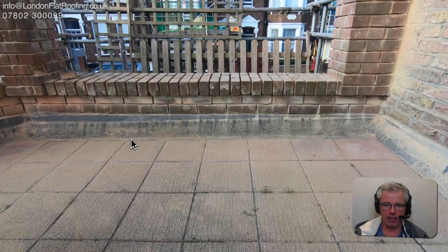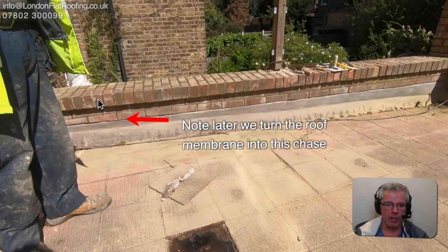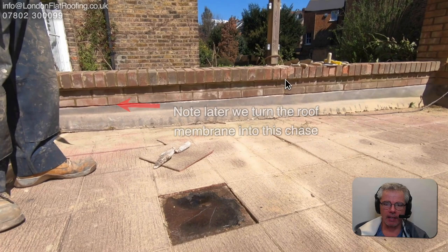You can see here we've raked out all the walls, all the railings are down over here, scaffolding around the outside. Nicely raked out, this joint across here where the new roof goes in is the most important thing. At the moment we haven't really tried to work on the tiles on the roof because we're too interested in getting the pointing done around the edges.